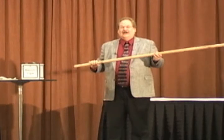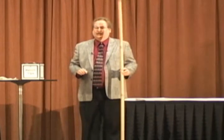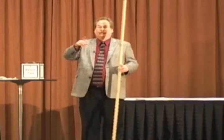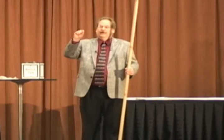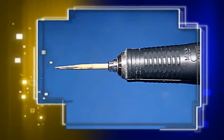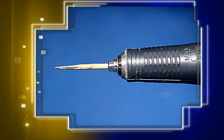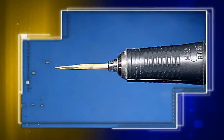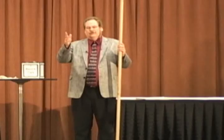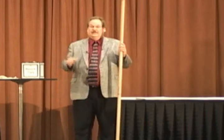Great item to have in the shop. Go to the grocery store, and you'll find in the aisles bamboo skewers, a little bit smaller than this one — they're for shish kebabs. That bamboo skewer is 3/32" in diameter, which means it will fit in a quick-change handpiece on your flex shaft or micromotor. Cut a little section off, file it to a point, stick it in your flex shaft, put a little rouge on there — great little polishing end to get into little areas that you can't reach with your felt wheels or other buffs. A lot of jewelers use toothpicks.